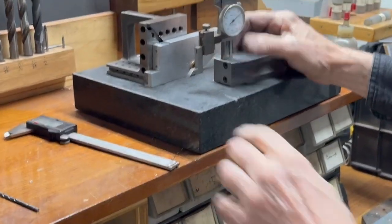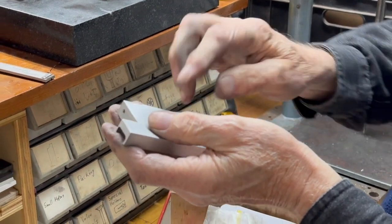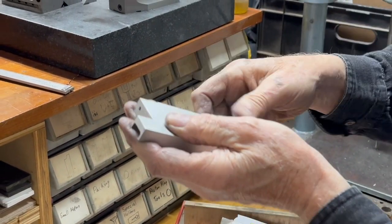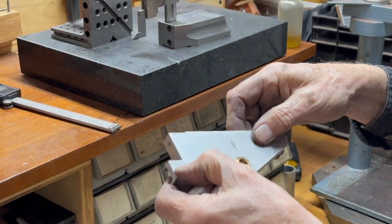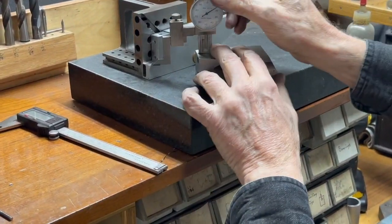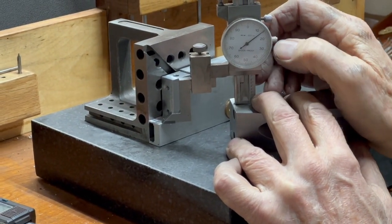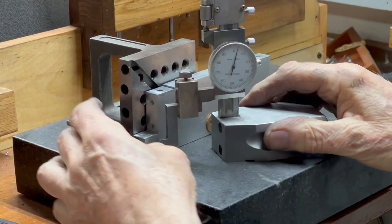So in the plan it says to see text about this notch, and what it tells you in the text is what I showed you. You put it together, make the mark, and then you mark it so it's 5/16 of an inch deep, and put the notch in. It can be a little oversized, it doesn't matter. So there's 5/16.